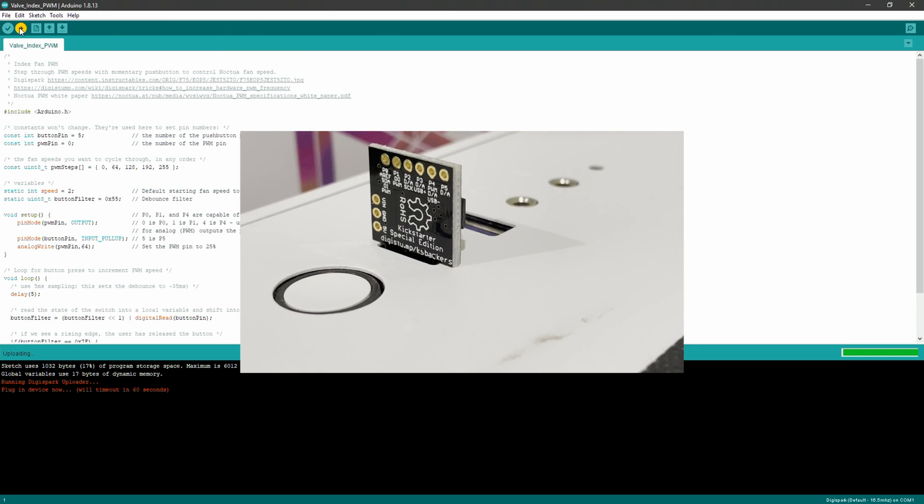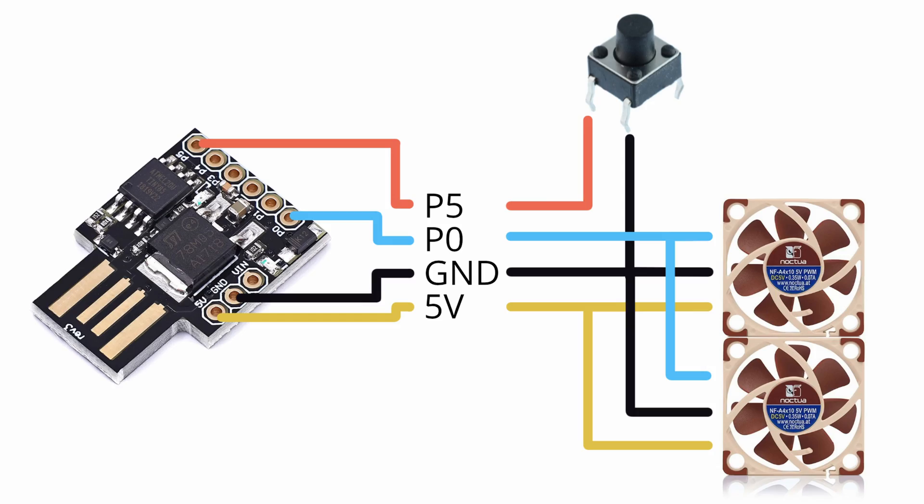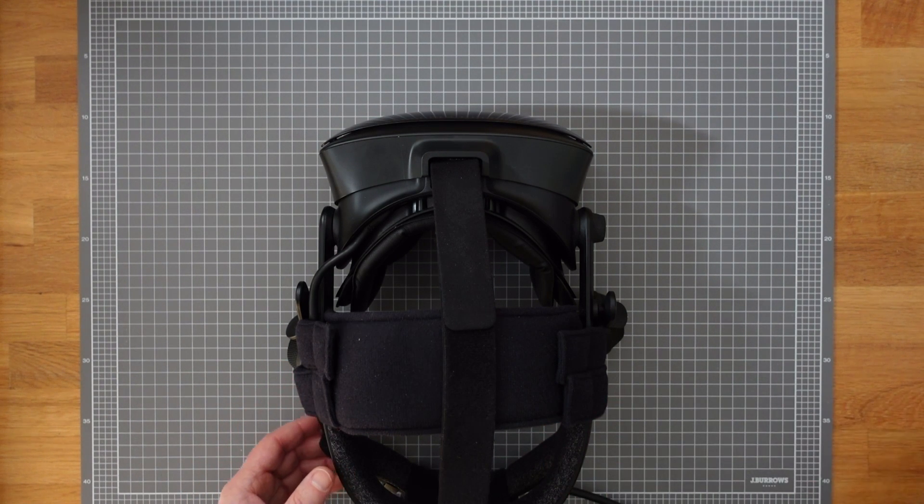It's pretty quick. Now you're going to need to drill a small hole in the 3D printed part as shown and then insert the push-button switch and hot glue it into place. The button should be able to be pressed from outside of the headset. Then install the fans with the labels facing the front of the fascia. This stops dust from blowing on the electronics and the air will not be blowing directly towards your eyes either. Then we're going to cut the fan wires to length and solder in the DigiSpark as per the schematic. You should then plug the DigiSpark into a regular USB power supply and test that the button presses change the fan speed. If all is working then great, we can go ahead and install it in the headset.